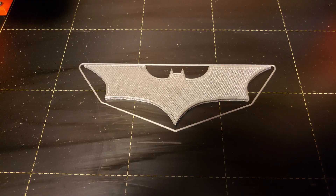So I loosened up the motor mounts, took the tensioning screw, and twisted it a couple of turns. Then I tightened up the motor mounts again and printed out another batarang. And this time there was no layer shift. It's still not as smooth as that first batarang — I don't know what I did, I absolutely lucked into the perfect print. But except for the tensioning of the belt, which was causing the extruder to go all the way to the right and lose its mind, everything else was working fine. I've tightened up the belt, and I noticed that the gap on that first layer between the outside line and the rest of the layer has disappeared. The batarang no longer has that layer shift.